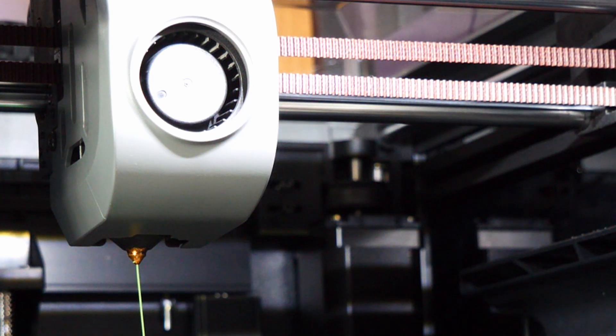Loading the printer is definitely not good for you. People seem to think that what you see is steam — it is sometimes steam, but no, this is actually burning plastic. It creates a lot more PM 2.5, regardless of the filament you're using, and typically on most printers your face is usually quite close to the printer when doing this. So don't do that — at least try not to — avoid breathing that smoke, because that is bad for you.